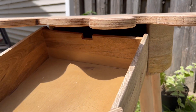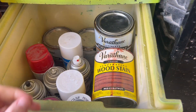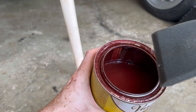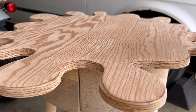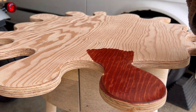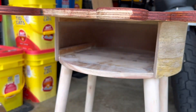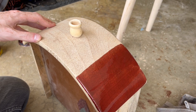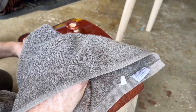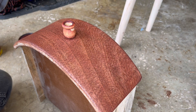Obviously you need a handle on a drawer to be able to pull it in and out. I chose this funky shape from the Hobby Lobby down the street but I had to change it in the end. Now it's time to put this thing back in the garage and pick a stain color. I just chose the last stain I used for a different project. We're going to pry the lid off with a flathead screwdriver, take a foam brush, dip it really lightly into the stain, and then lightly drag it across the wood. I'm not painting it on, I'm not smearing it — I'm just lightly dragging it. Then we're going to use a towel to wipe all the loose stain off. I was about 90% done with the top before I got a drop onto the front of the drawer, and the issue is if you let stain sit too long and then go over it with a different coat, the spot will be darker than the rest of the finish. So I quickly wanted to get this done to avoid that issue. I want to reiterate that I basically have no real idea what I'm doing — I've just played with stains and wood a lot, so I have a general idea, but I am not a professional woodworker. I just like to make stuff.